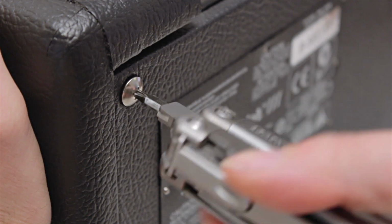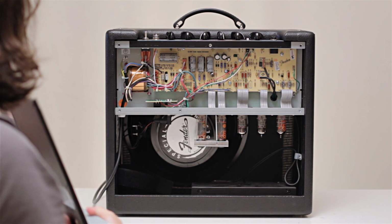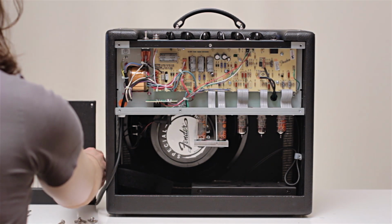So as far as I understand, this is because in the power section, the tubes are working together, unlike the preamp section in which each tube is acting as an isolated gain stage. So the tubes in the power section need to have matching cathode current, which may not be the case even if two tubes are the same type and make, and even made at the same time, they can have variation in the cathode current. So that's where companies like the Tube Amp Doctor come in and test the tubes to create matching pairs or quads if needed for more powerful amps.